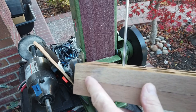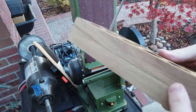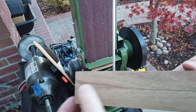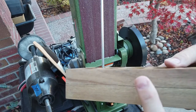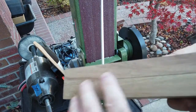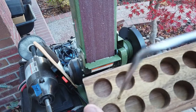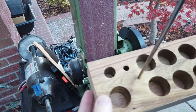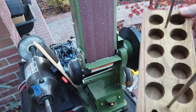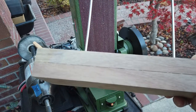It's getting a little too dark tonight, so we'll do this over the weekend — we will cut this dado, and that will be a nice oak insert. It serves two purposes: one, to eliminate this line, and two, to give it another flavor once these two woods are treated with teak oil to give them a much richer finish, then offset with a lighter oak, which I think will be a nice pop. Then I'll go in and do the holes with the teak oil. Liking how it's coming out — looking good, smooth sailing for now, more to come.